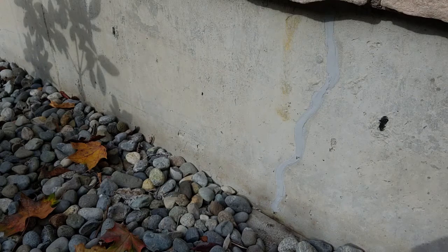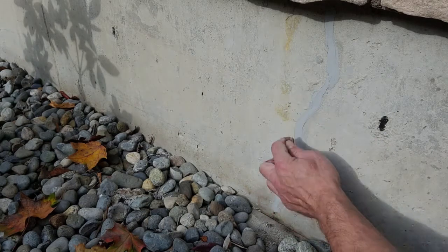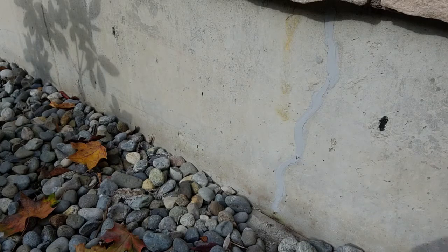This will give us a way to see if it opens up. If next year you see this crack coming through the sealant, then something happened — we have ongoing movement. When you get a home inspection, the inspector is only there for about three to four hours, so often those clues might not be showing, and it might be something that's happening extremely slowly as well. So now this will give you the option to monitor it.